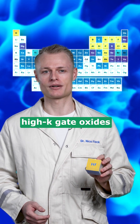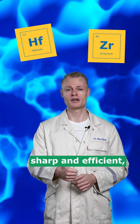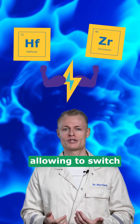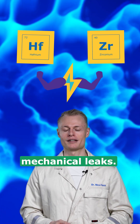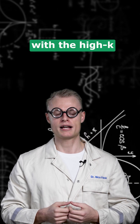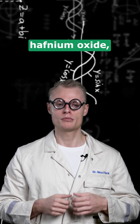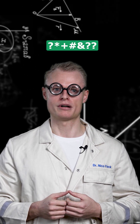This is why we switch to high-K gate oxides based on elements like Hafnium. These keep things sharp and efficient, allowing transistors to switch even faster without losing energy through quantum mechanical leaks. It actually turns out that a very thin adhesion layer made of silicon dioxide in combination with the high-K dielectric layer made of Hafnium oxide performs the best. This double layer outperforms the very thin silicon dioxide layer on its own by far.